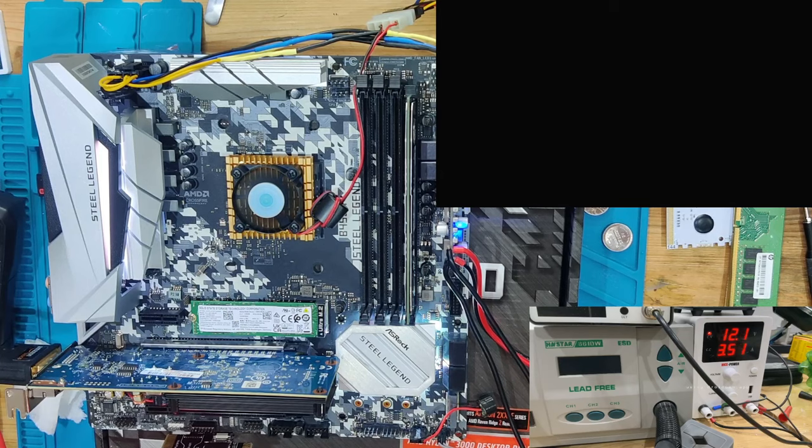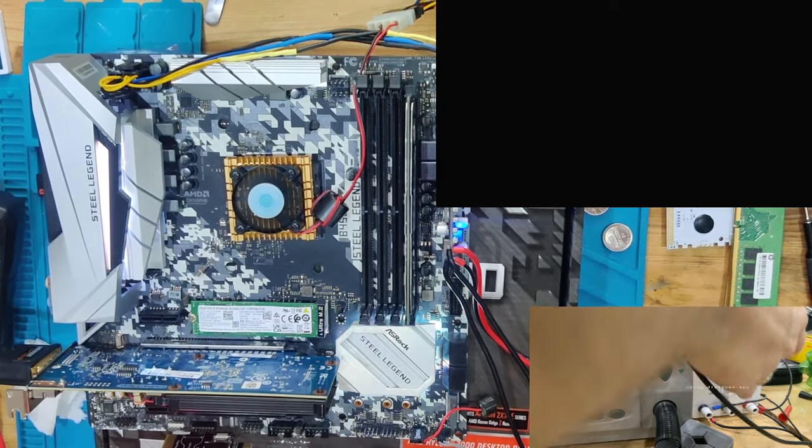What I would expect if the PCIe slot now doesn't work is some physical damage to the pins of the PCIe slot, because there's a lot of pins under there, as you would probably know, and they could have lost contact because of a heavy GPU, wrong mounting, wrong disassembly, a lot of reasons. And we still get that post beep. So we're going to turn off again.